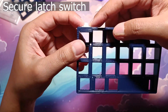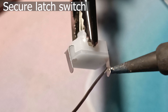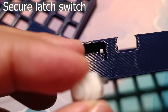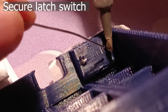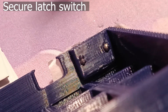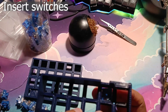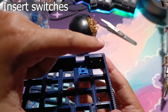Next is to put the switches onto the top case. Lightly tin the switch legs, slot the switch into the case, and then solder the legs with more solder. When inserting the switches, make sure the switch legs are on the top side and ensure that the switch hole under the switch is empty, because that will be inserted later.